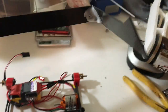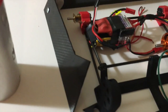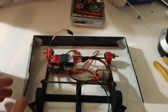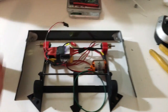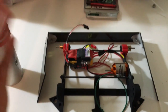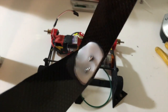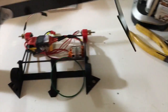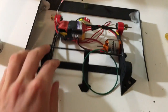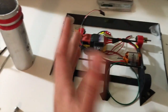Another change is the armor. I went with carbon fiber armor, which looks very cool but isn't actually great for combat robots — it tends to be brittle. The reason I used it is I had a lot of surface area to cover and needed something light and stiff, and carbon fiber fit the bill. The corners are shape-lock plastic; they look a little jankier than they actually are, but they hold things together quite well and I don't predict the joints will fail.